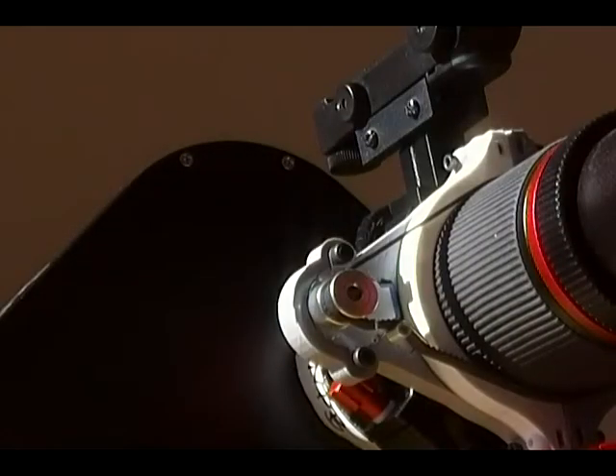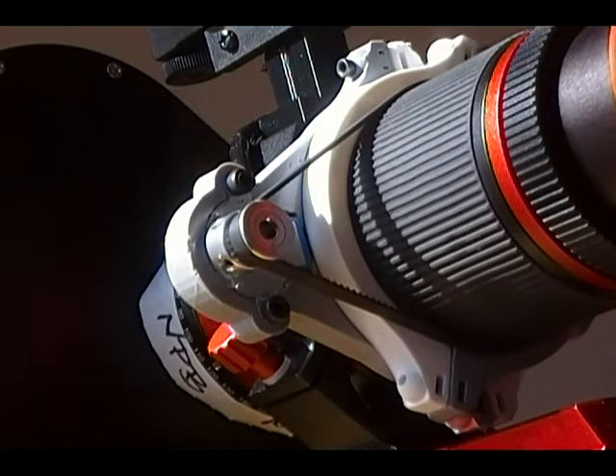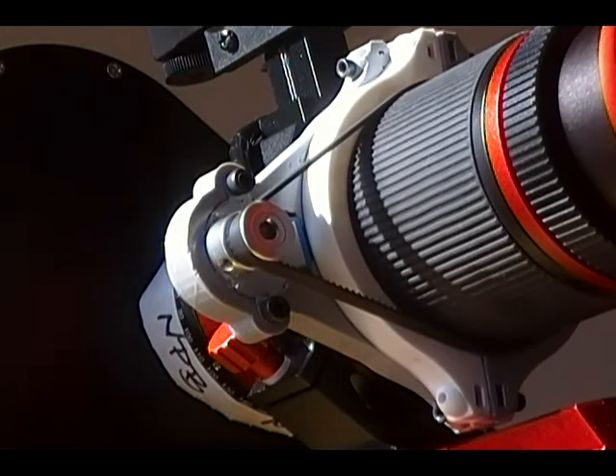I tried using a belt tensioner. It takes up the slack but doesn't help with the backlash. In fact, the backlash looks worse and the error accumulates. With no tensioner, I get pretty good repeatability of position. The backlash doesn't seem to accumulate either.